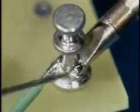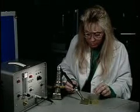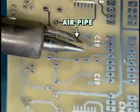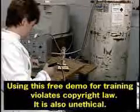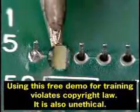Flow the solder in and then remove the solder and iron simultaneously. Some soldering irons have an integrated system that provides heated air or nitrogen to the connection area during the soldering process. When using a low residue flux, this heated air can more effectively remove the volatiles, leaving a reduced volume of visible residue. If nitrogen is used with the same system, it will still remove more of the residues than a standard soldering iron. It may also have the benefit of improving the wetting performance by eliminating or reducing the effects of oxygen during the soldering process.